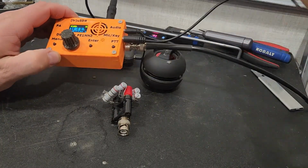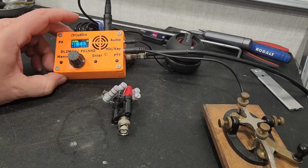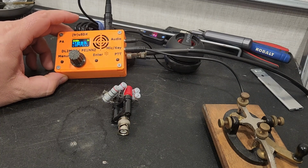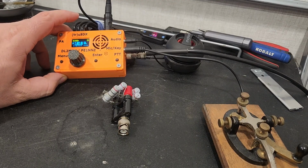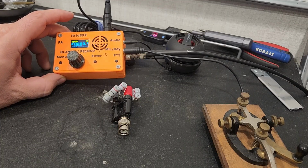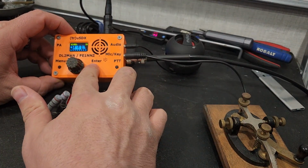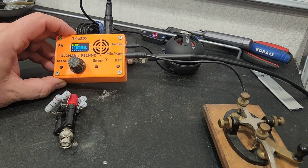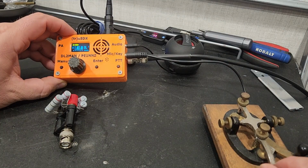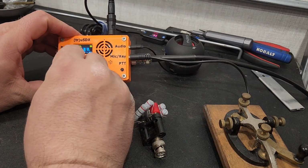That's going to bother me. Let's just get that wire over here. Let's get that speaker sent back there. And let's see. So let me first tune up for the right frequency here. So I need to be over here. That's pretty good. SWR of 1.07 on the first try. You know, I don't like to tune up without identifying. All right, let's go and find some stations.